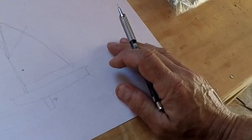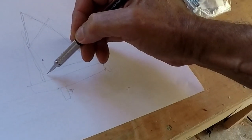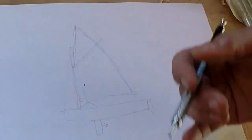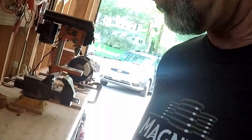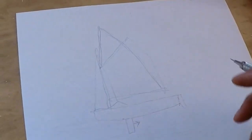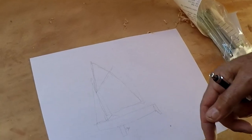In the meantime, by putting a jib up — there's not much room but I could let it overhang the mast a little bit — I think it helps efficiency-wise to come close to the wind, just like a double-slotted flap on an airplane seems to be slightly more efficient. It would help to move the center of effort forward a bit and balance the helm. The only real issue with a lot of weather helm is it's slightly inefficient — you're sort of dragging the rudder through the water more than you need to.